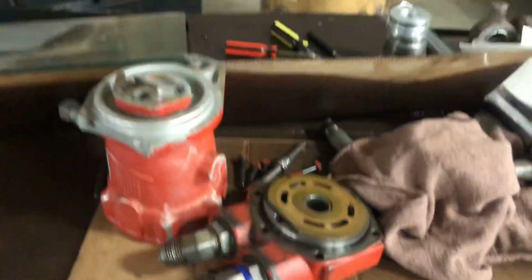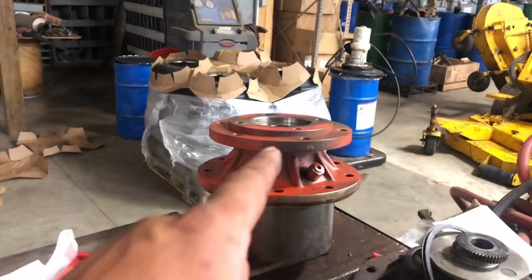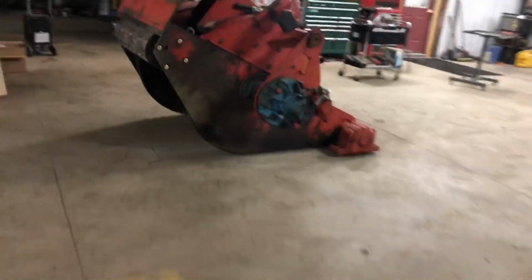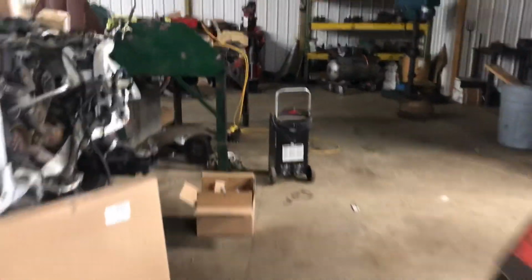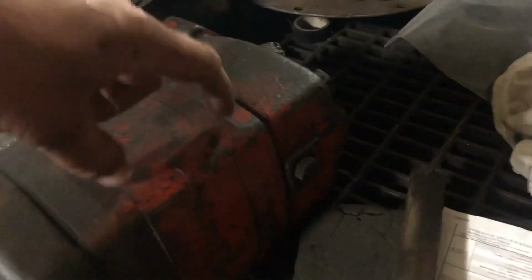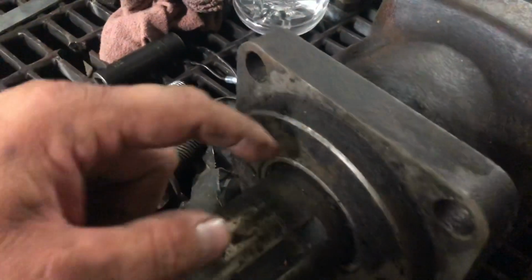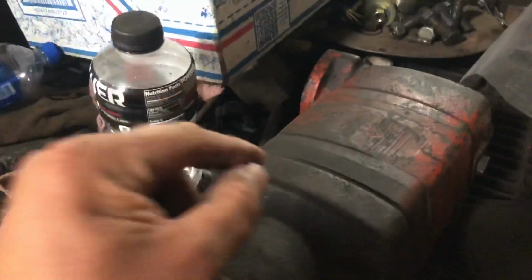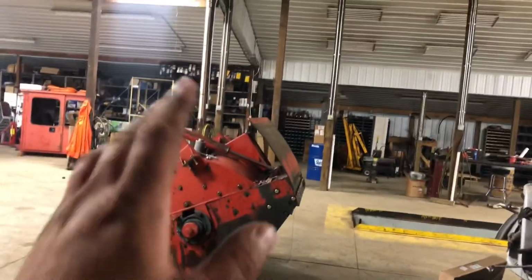That's the motor for the feed wheels. That connects to that, and then that connects to the feed wheel on the bottom rollers. So rebuilding that one. And then we have, he must have set the motor over here. Where did he set that at? The old Charlene. Yeah, he's got it set over here. So he'll tear this one apart tomorrow. Pull the bolts out of here, and then pull these apart, and change the shaft steel, and so on. Gets it all fixed up, and then we put it back in there. Then that one will be completely done.